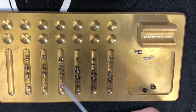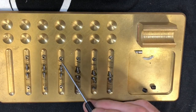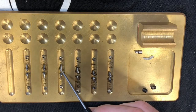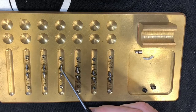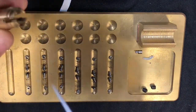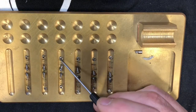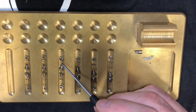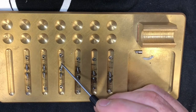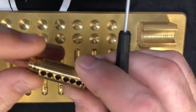Now this little donut that sits on top prevents the pins from coming out. So in other words, the flange around that mushroom part can't protrude through here, but the tip of it can, and then it can't protrude through this little donut. So each of these spring pin donut assemblies constitutes a discrete object, which is then captured inside of this core.